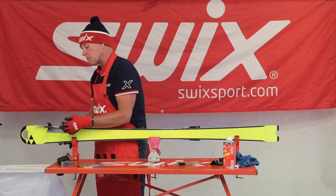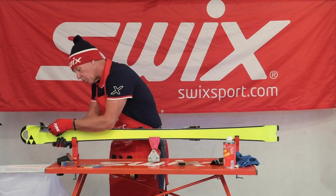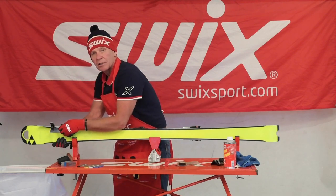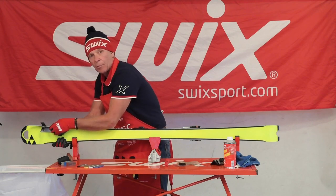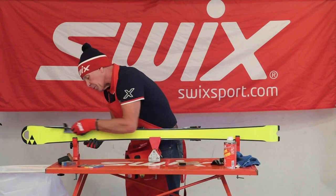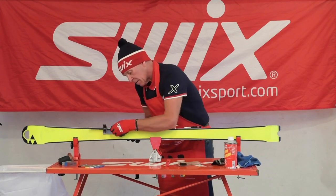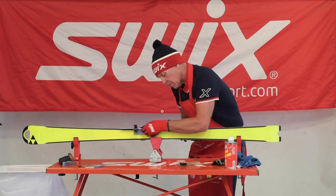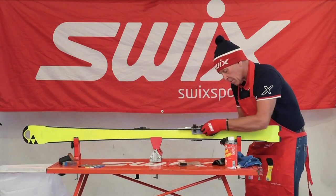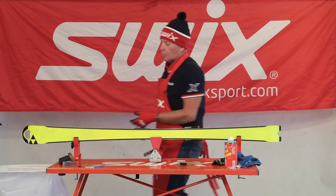The first step is I'm going to be very aggressive, using a three-inch overlap. When I pull towards me, I'm pulling with pressure. As I release, I don't want pressure on the file — I just move it forward without pressure. So we're looking right down at the edge with good pressure, about three-inch overlaps. Then take your brush.